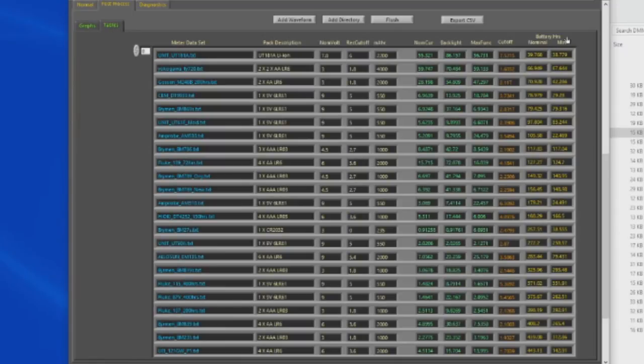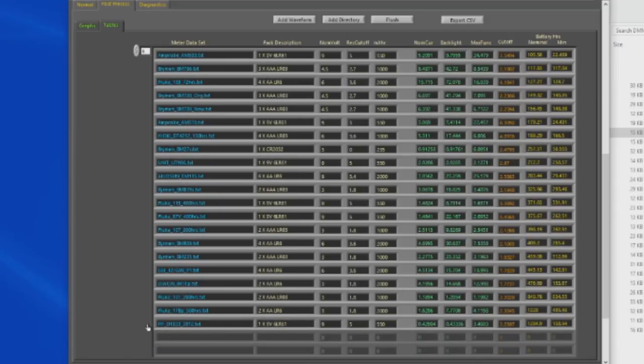To the far right, this is looking at the nominal battery life. You can see the worst meter by far is the UNI-T UT181A at about 40 hours operation. And the best meter to date has been the free one from Harbor Freight. This one will operate off a single 9-volt transistor battery for about 1300 hours.